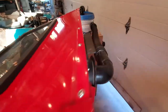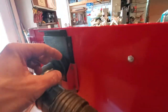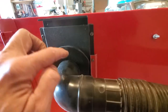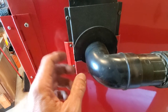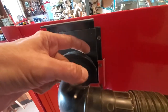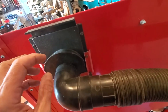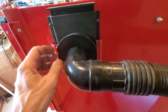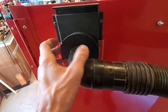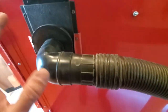I used a four-inch blast gate in the back — I had some left over from woodworking. I cut it a little bit narrower, down to about three-quarters of an inch wide at the slot so it fits inside. I'm using the cap that came with the cabinet from Harbor Freight, and made a little clip from the last pieces of the flashing tray to hold it in place. Because I cut the width of the blast gate down a bit, it was a little loose, so I made an O-ring. If I ever want to take it off, the elbow comes off along with it since it's hot-glued in, making it lower profile for moving through doorways.